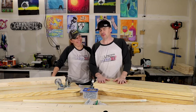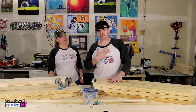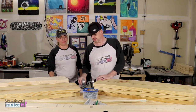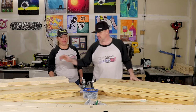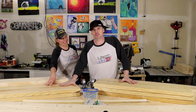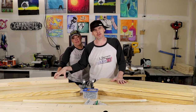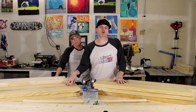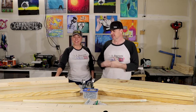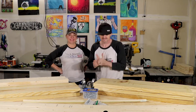Bad news. Oh, man. Look, there's gonna be a lot of pocket holes needed for these things. I got a trick to do my pocket holes. I don't know how good you guys are. So we're gonna need to put pocket holes in the 2x4s that are cut to 37 and these big 2x12s need some pocket holes also. We're gonna pin the 2x4s to either side of these 2x12s to make a long, sturdy, heavy 18-inch shelf. I'm gonna show you my trick and then you show me yours. Ready?